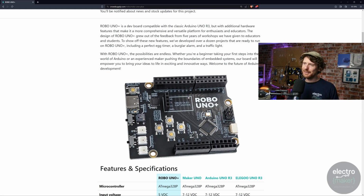This is really nice because this shows where a little OLED screen could connect onto it, showing the footprint of it as well if you wanted to use it with an OLED screen. But at the end of the day, ultimately, this is the same kind of board as the original Arduinos, with the ATmega328P chip in it that many people started with and then later went on to program by getting the datasheet through, because again, it's a fairly easy microcontroller to learn and the datasheet is not that dense.